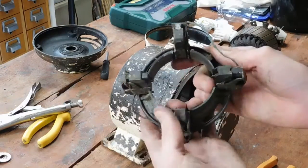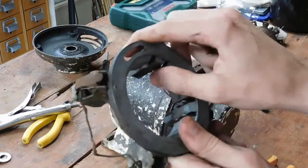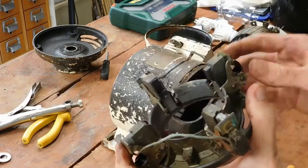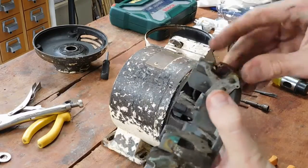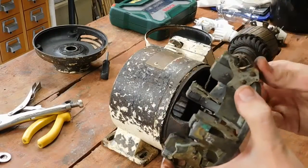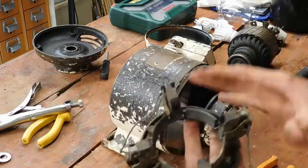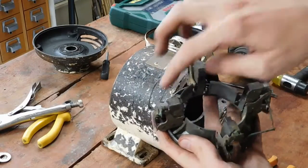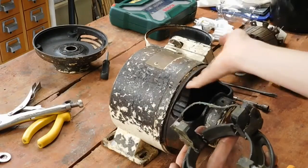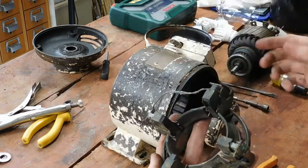And there's our brush ring, and that just fits over the end, and the plate acts on these little lugs here, and that's what pushes the brushes back. It's fairly simple, although it's not quite fitting together properly, but you get the idea. Just goes like that. All of that can come apart. As you can see, there's a bit of copper wire connecting both brushes. That's because your AC goes in either one, in parallel with the stator, and power goes first to these brushes, getting the motor started.